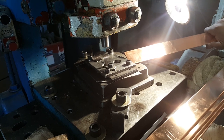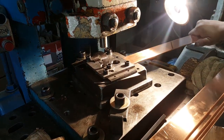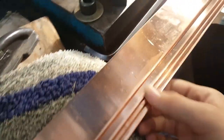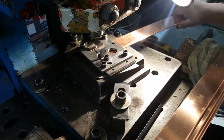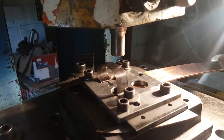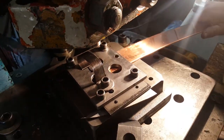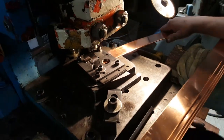After the dies are finished and treated, we will work on blanking. So we're taking sheets of — this is copper. The boxings are in brass. The clips are all in solid copper. And we'll run it through this blanking press. It's kind of like a cookie cutter. There's just this big cutter that's going to come down and punch out a whole lot of copper.